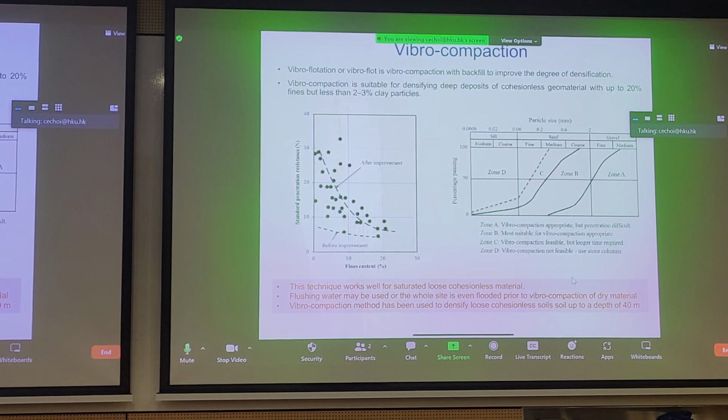You might be thinking, how do we characterize the ground improvement for such complex empirical methods? Well, what do I mean by that? How do you know as an engineer that the strength and stiffness properties of a site have improved? We'll spend some time on a module later related to in situ measurement of soil strength and stiffness. Some methods we can use include SPT, CPT. CPT probably less reasonable for granular material.